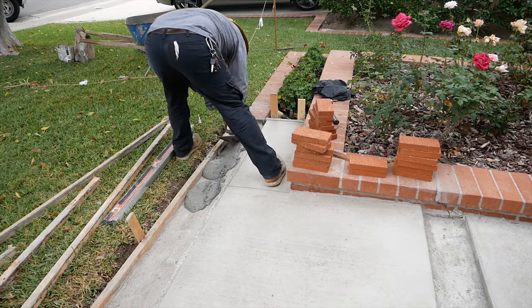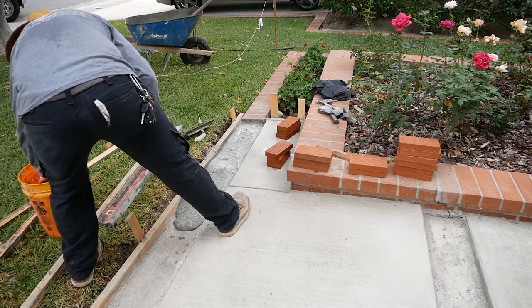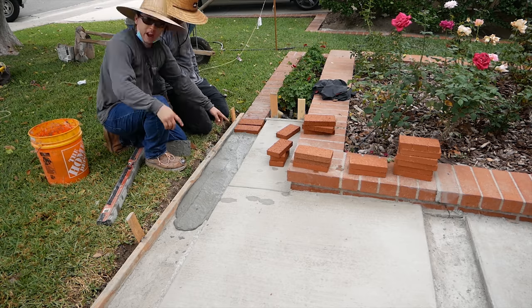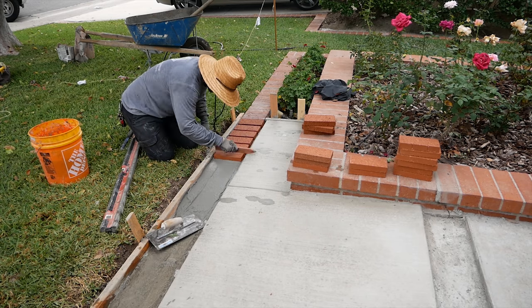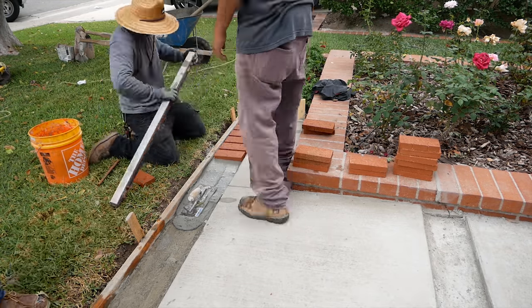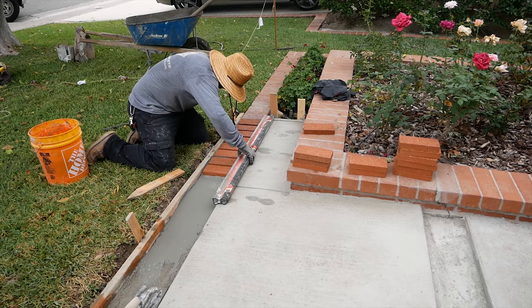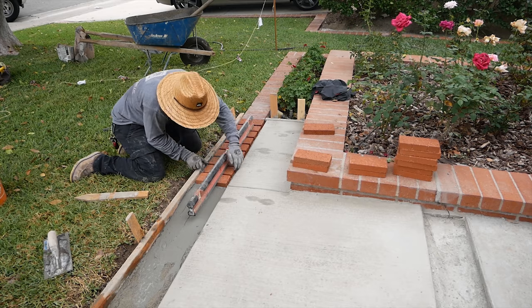Now here's your thinset. This thinset happens to be mixed with a little bit of mortar, which gives you more body and dries a little quicker. You still get the great bonding that thinset offers, and the mortar gives you more body and makes it dry quicker so you can keep moving. With pure thinset, bricks have a tendency to move when you place the next one. When you get mortar mixed in, you can set a brick and it's not moving when you drop the next one behind it. That's why I like to mix thinset with mortar — you can do everything faster.